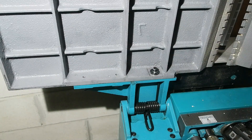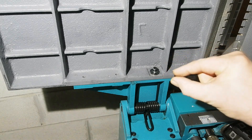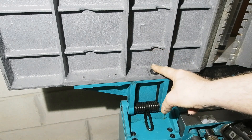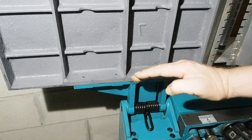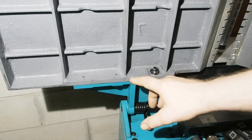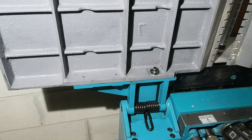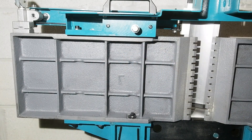Mine wasn't catching at all, which I thought was going to be an issue, as the back or hinge side of the outfeed table has factory-set locating pins. Thankfully there is a fraction of a millimeter play in the locating pins, so undoing the two bolts nearest the block — that fraction — meant the inside corner did eventually catch the cutter, giving a 4mm drag on the rule. If you needed more play for adjustment than that, you'd have to remove the table from its hinge and grind off one of the locating pins, but a fractional adjustment goes a long way here so you shouldn't need to.